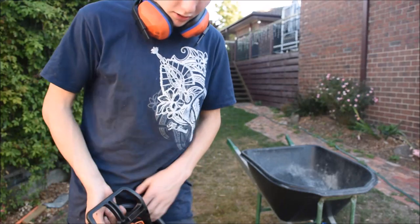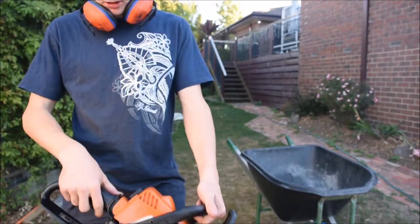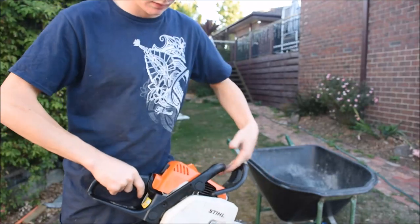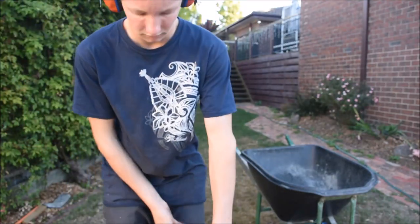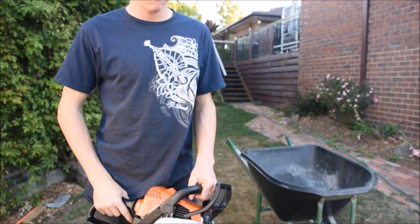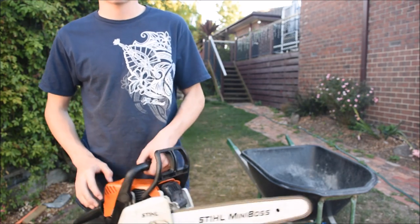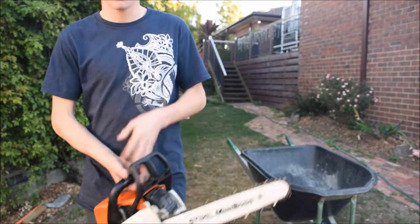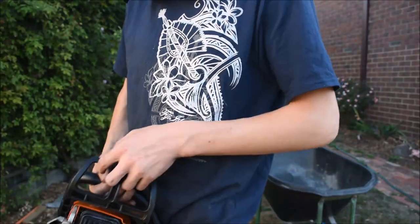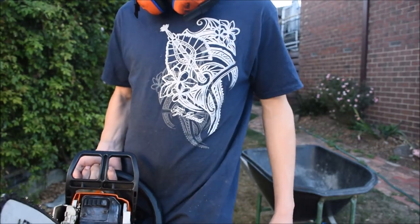Back out here again — I've cleaned out the intake. The saw probably needs a bit of a clean but that's the owner's job, not mine. Start it up and see what happens. There we go — so much more responsive! Just that simple bit of mesh can stuff up the saw a lot. Even being a little bit clogged can affect it. Hope this helps — yeah, go Australia!